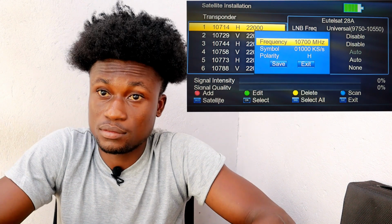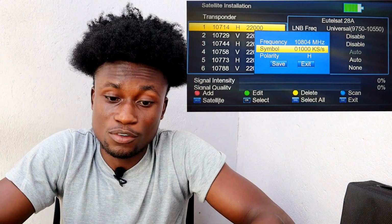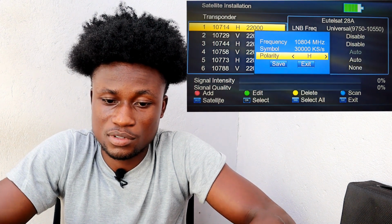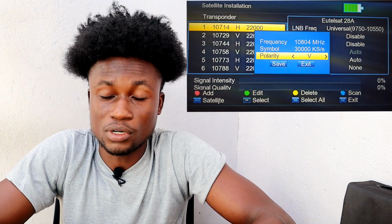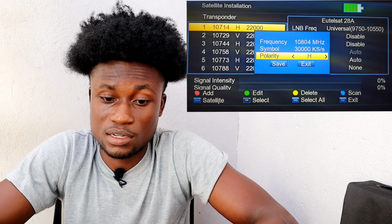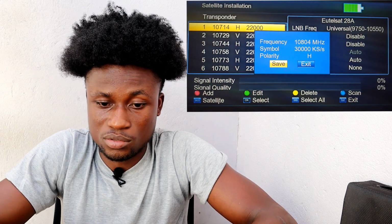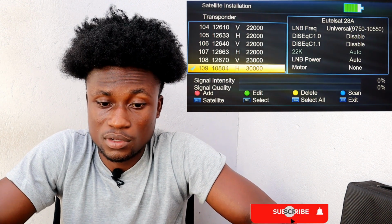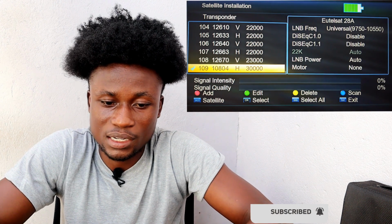So you add the MULTITV FTA. So MULTITV FTA 10804, 30K 300. And then you come down to polarity, which is H, horizontal. If it's vertical, you change it to V. Okay, so you do same if it's MULTITV, which is 12525, and you save. So after saving, you need to highlight it by marking it right here.